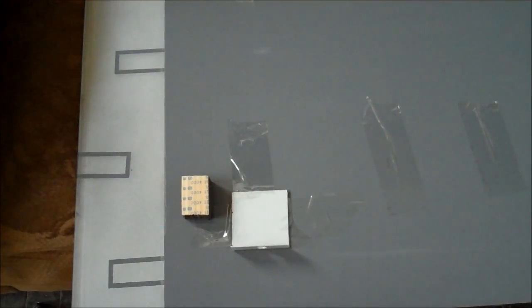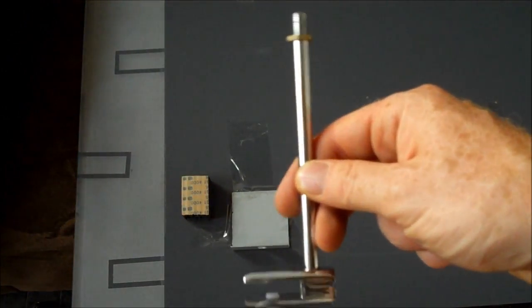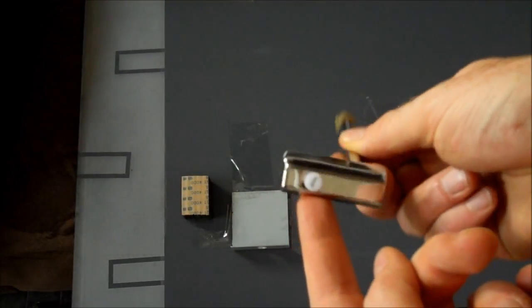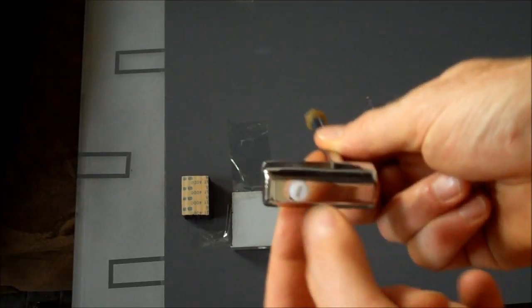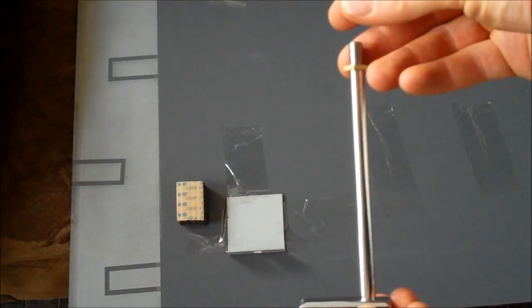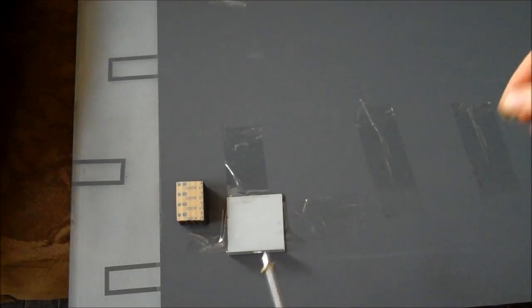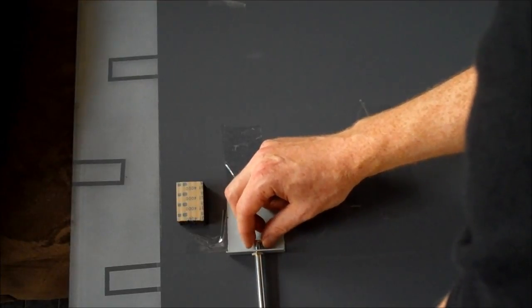So we put the nails, the L-shaped screws, into the wall, and now we have to attach the shelves, the L bar that holds the shelf. But if you see over here, we have a little plastic screw that has to be removed before we attach the shelf. So now that we have the nails in the wall, we have one more step before we can hang it. We have to put on the L brackets for the shelf. So what we're going to go ahead and do is, you see, we take one off, leave one on, put it in place, and tighten the nut.